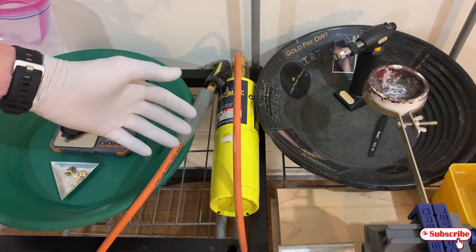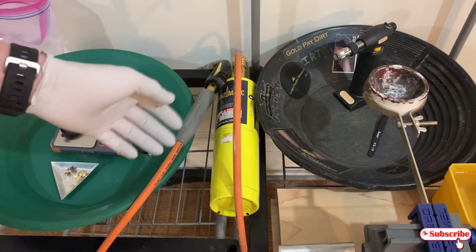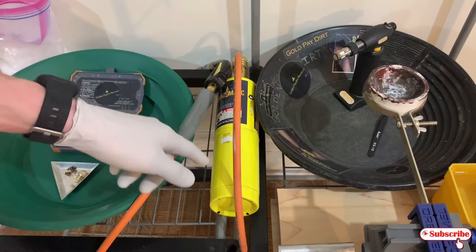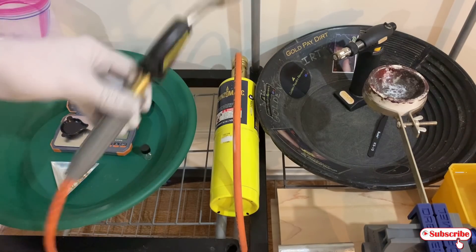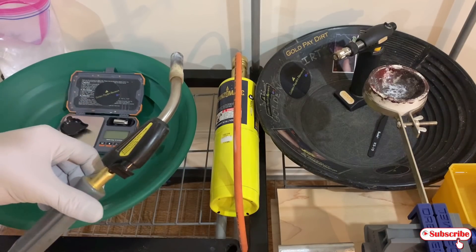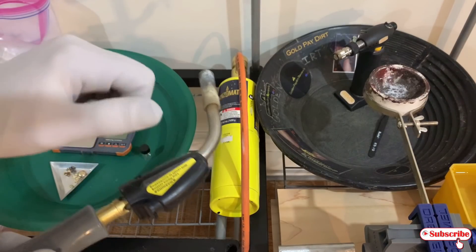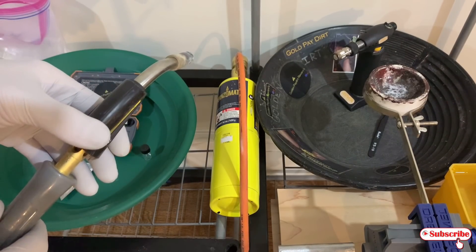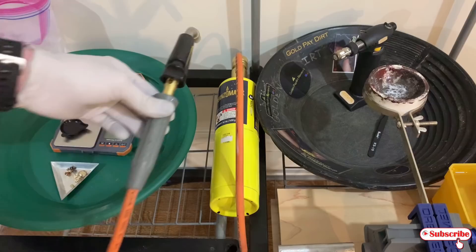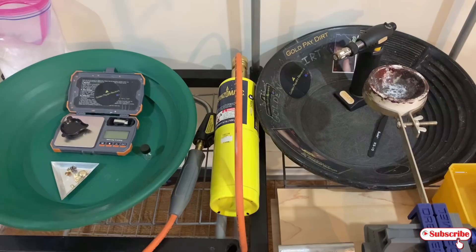You're going to need some map gas. Map gas is what you really want to melt gold with, or anything of that nature, because it burns harder. I use a speed torch tip — you don't have to use this one, but I have it in the description page below. I do plumbing with it also, but this is the best speedy tip I've ever bought. It burns really, really well and it has settings.